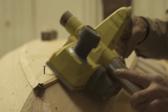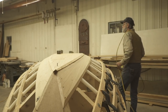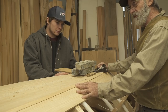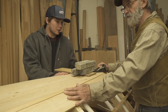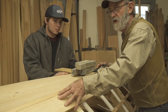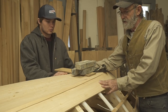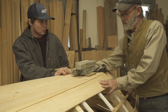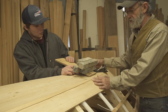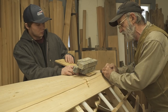You have to be careful when you get right down close to the garboard plank because you can eat into it very easily. I haven't lifted any bevels or made any calculations — what I'm doing is using the heel end of the electric plane to skid along the garboard plank to dictate the cut I make on the outboard edge of the bottom itself. I've come up with a little method to hold the very edge of the bottom down nice and tight: a piece of plywood with four weights — maybe 60 pounds — tipped up at a slight angle to put all the pressure right along that edge.